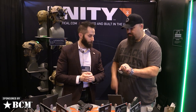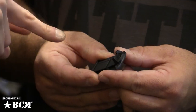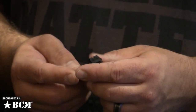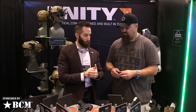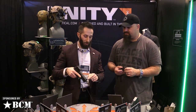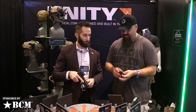The system is quite thin — you're not cutting very deep into the slide. Every plate has an integral rear sight built in. In ADAM 1.0 the rear sights were set up on the slide itself; now we're integrating them into the plate. We can do rear or forward-mounted irons, and the plate height for those irons is based on whatever optic it's paired with so you can co-witness through the optic. You'll use a suppressor-height front sight blade and you're good to go.